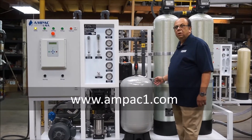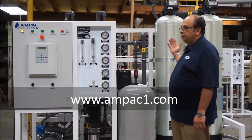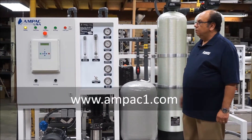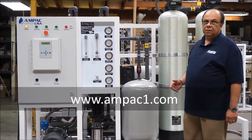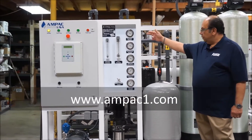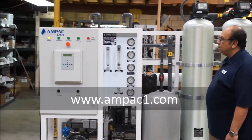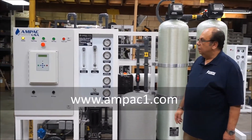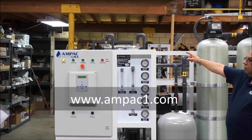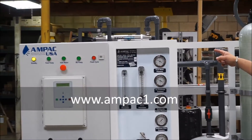The RO pump will boost the pressure of the water and take it to the membrane elements in the back. The membrane elements will remove salt, and then the water will go into your permeate or fresh water storage tank. Once the tank is full, the system is capable of flushing itself — filters draw fresh water back through the sediment filter and flush the whole system with fresh water after each use. We also have an ultraviolet unit at the end of the operation, ensuring the water is not just pure and salt-free, but also disinfected and sterilized.